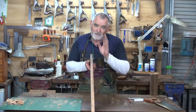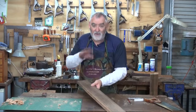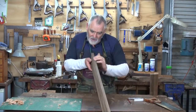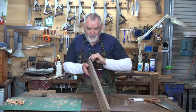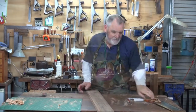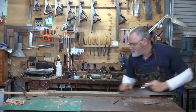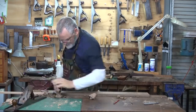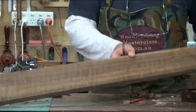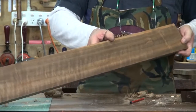Now what I'm going to do first is just flatten one side, so then I know I've got a true side. I know I've got a straight edge here, and then we'll take a measurement to see how far out we are. It's only about a mil or so. Alright, so that's nice and flat. As you can see that's all nice and clean, and it has got a fair bit of figure in it.